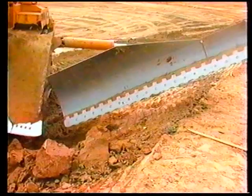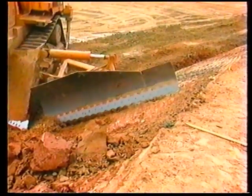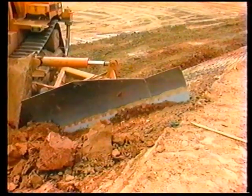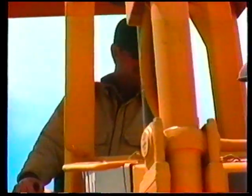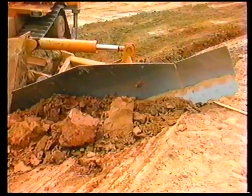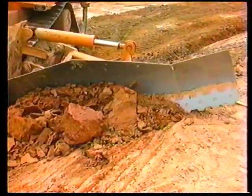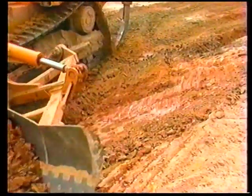Also, allow the lower portion of the slope board and corner bit of the dozer to move up the slope towards the hard material. Both of these areas of the machine have a better chance of cutting out the hard area. Remember not to cut too far up the slope. If the hard area of the slope is long and can't be completely cut out in one pass, it may be necessary to make a number of similar passes cutting up the slope, each pass moving forward.